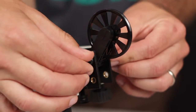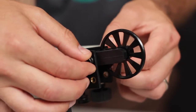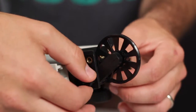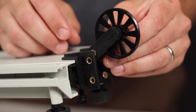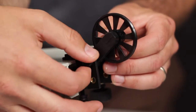The height of the pulley can be adjusted in the clamp by loosening the two thumbscrews on either side of the clamp. If greater height adjustment is needed, the pulley can be moved to one of two mounting positions in the clamp. To change positions, remove the two thumbscrews on either side of the clamp and adjust. Once the pulley is in the desired position, replace the thumbscrews and tighten to hold the pulley in place.